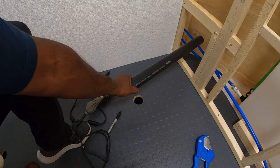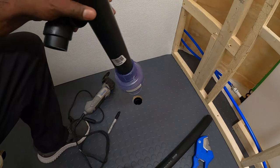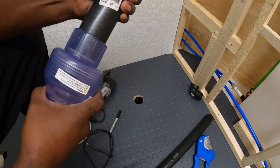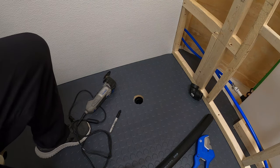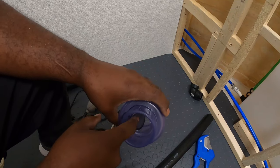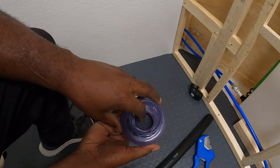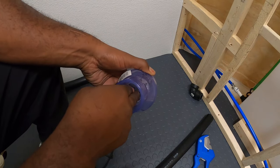then go up. What I wanted to do was have this check valve. It's a 2-inch PVC check valve, if I can get it off this pipe here. Good grief. 2-inch PVC check valve. It's a one-way check valve. So basically if the air is being sucked down into the tank when it's being emptied, air can go down. But if the water ever backflows, it can't come up into the airline.